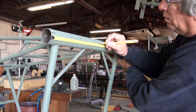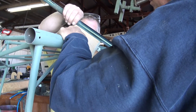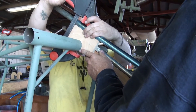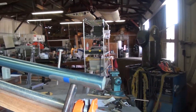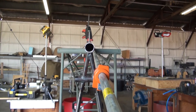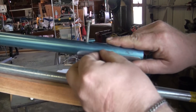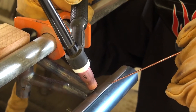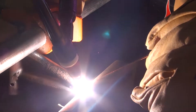We will start by finding the center of the main spar tube and then mark the width of the positioning block, which is manufactured from 3/4 inch plywood. Place the positioning block exactly centered from right to left on the spar tube. Then with the keel pocket attached to the 1 inch diameter tubing, we can position the keel pocket very accurately. By using a 3/16 inch bolt through the mounting hole on the keel pocket going through the 1 inch tube, we can ensure that the keel is aligned vertically with the fuselage frame assembly. Once all distances and alignments are correct, remove the positioning tape from the keel pocket and we are now ready to tack weld both sides of the keel pocket to the instrument panel sub-assembly. If you are using an aluminum tube or a wooden dowel, it won't fuse with the keel pocket during the tack welding process.